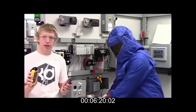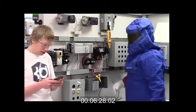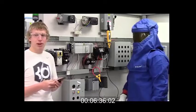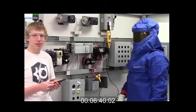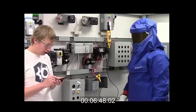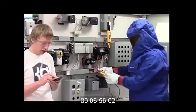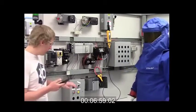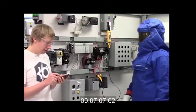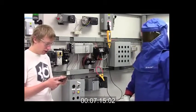We'll disconnect from that one and now connect the Fluke to this one. I'll start my recording and then we'll turn the motor on and monitor it for 10 seconds to see if there's any rough spots, which would cause a spike in current and a changing value. Now that it has shut off, we'll save this to a design folder under the north diverter gate for line one current. Now Travis will move it and we can do the line two current to monitor that also. I will start my recording again, turn the motor on, monitor it for 10 seconds so we can get a good graph. Now that it has shut off, I'll save that again and Travis will move it to line three. We'll repeat the process one last time and save this last one in the line three current file.